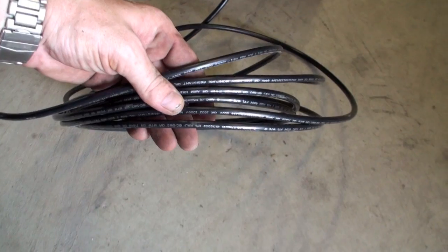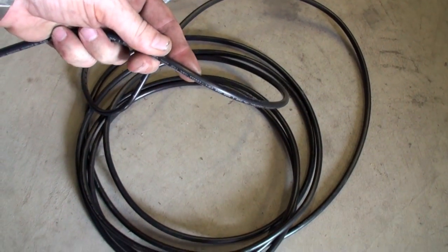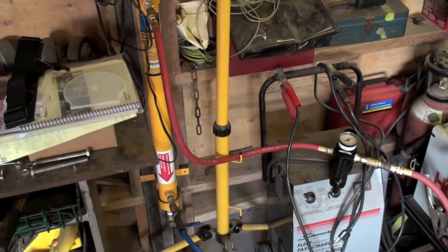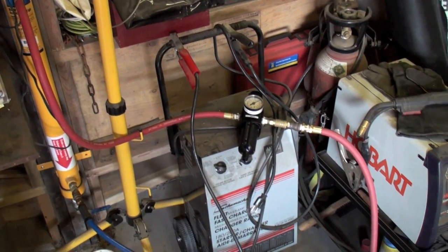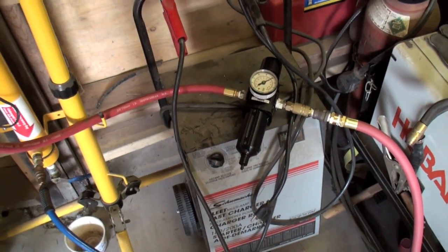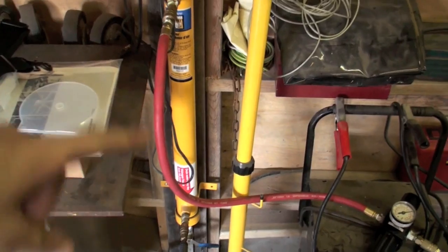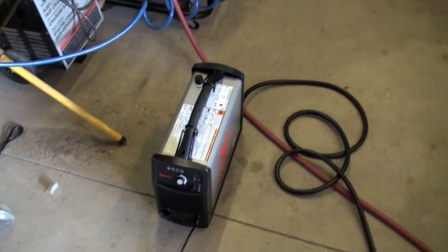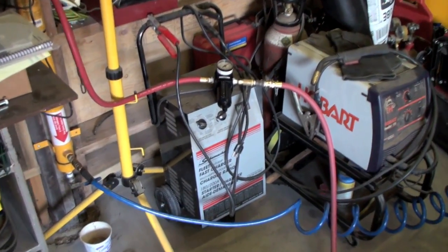That's it — they don't make anything else. They make the parts for Miller plasma cutters as well. Look at this wire for the ground — that's all you need, apparently. One thing: to hook up this dryer, it recommends 25 feet between the compressor and the dryer to cool the air before it gets there. Then I had to take apart my regulator because it had an oiler on it, so I just separated the regulator and the filter. No chunks of silica or whatever get blown through into your cutter, because it doesn't take much to wreck one of these. You want to keep the air nice and dry, and not below 80 PSI or above 100 PSI.